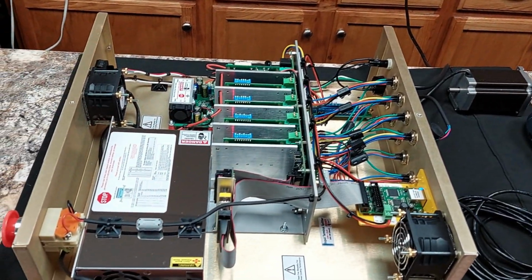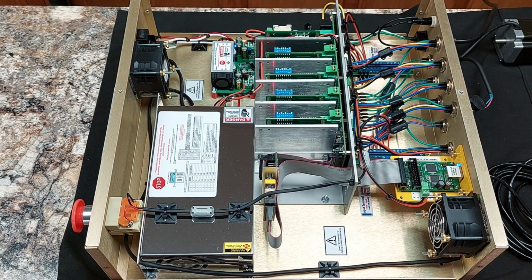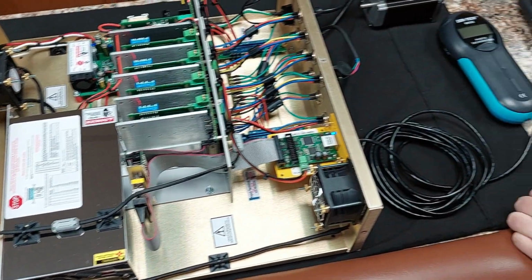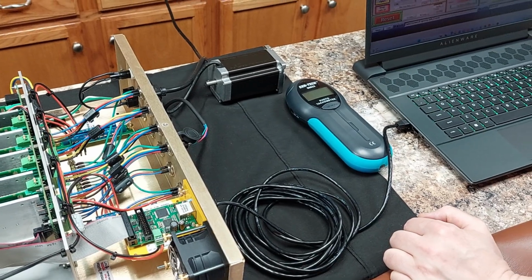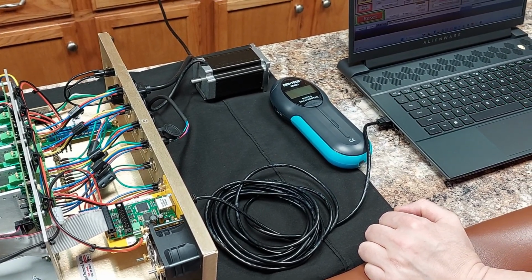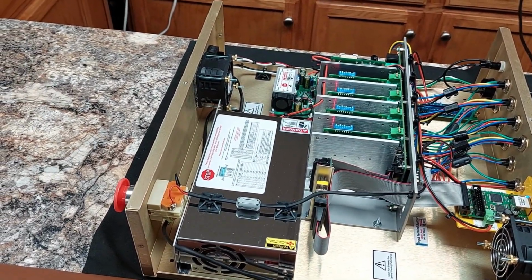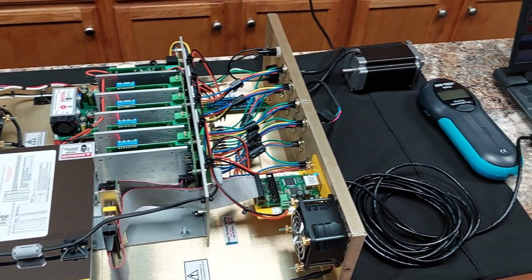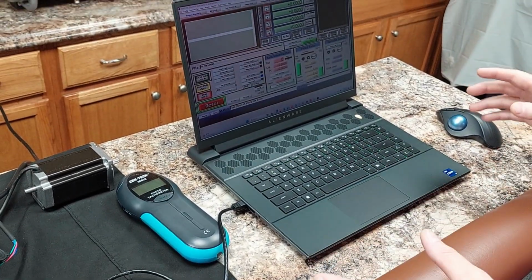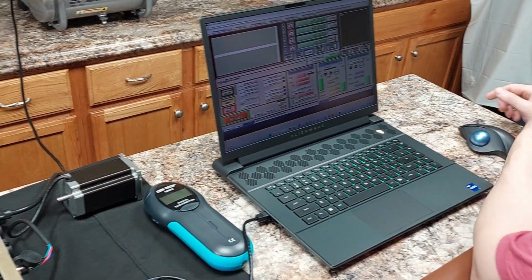That's truly amazing. So keeping in mind how many of you have asked me questions, what kind of performance can I expect with that system on my router or my mill? Think about what you just saw. Whether or not you get even close to that RPM, let's say out of the 5,100, you do get 3,000, which probably is close to what you'll actually receive, maybe even a little over that. That's still amazing, because that's usable torque. I mean, that's usable in the sense that you're able to not necessarily machine with, of course, but able to do rapid motion, which means it's going to speed up your manufacturing process massively, and all with using a 50-volt power supply. So amazing what we just saw, and hopefully you guys will stay tuned, and I will do the update as we get the DB25 sorted out, and in this way you can see exactly what's going on. I'm going to cut over now.